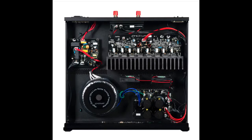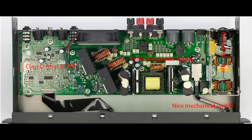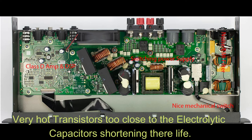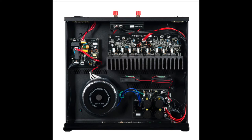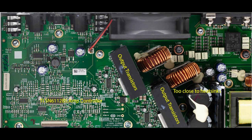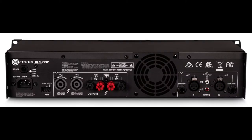So you have to put the Crown on top of something if you're not using another Crown — that's a big no-no as far as I'm concerned. Looking inside, the Crown is crunched together with really compact size and no breathing room. The electrolytics are way too close to the power transformer, which could reduce their life. The Emotiva very well isolates the power supply electrolytics from the transformer as well as the input and output driver stages. Both use fans — the Emotiva uses two small fans, the Crown uses one — but in my experience I've never had any of these fans trigger or get hot. Both run very cool to the touch, with the Crown running much cooler than the Emotiva.